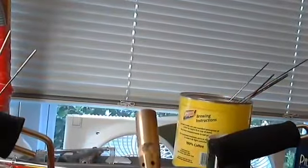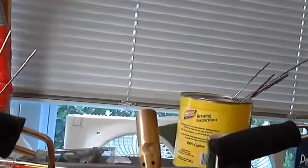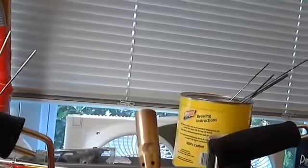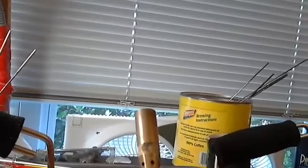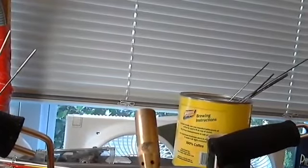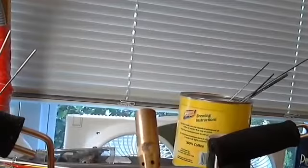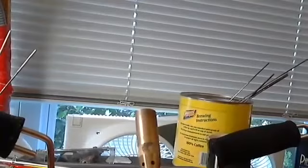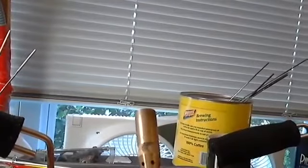So question, Lisa, once the bead's put in the vermiculite, approximately how long should you allow it to cool? Super question. Part of that depends on the size of the beads. The sizes of the ones I'm making, probably within 20 minutes, they would be fine. However, as I keep putting more and more beads in there, there's going to be more and more heat, so that's going to make the time it takes them to cool down longer. So just be aware of that. I have a backup can of vermiculite that I can switch to because I've got a lot going on in there.